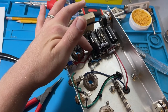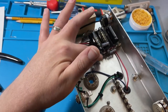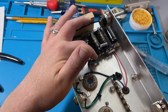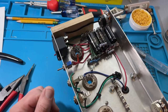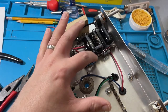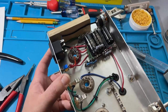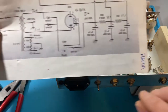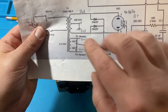The reason I landed those two green wires to two terminals here is it gives me a good landing point. I could have run them straight to a tube socket, but I can run wires off of here pretty easily. I can also later use this if I'm going to add an LED or pilot light in the circuit — I'll show that later. If you're using the Hammond you don't have to do that — you could put the green wire straight to the first tube. The heaters are usually pins 2 and 7 on the tube sockets.